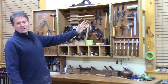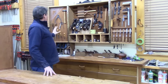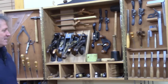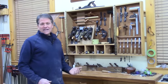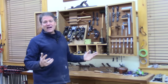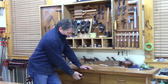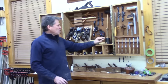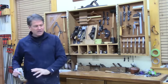I did that on cardboard before I got too committed to doing this. I decided to put my marking tools on the right side because I'm usually marking and cutting dovetails down this end of the bench. The planes had to go in the center section because they needed more depth. The saws seemed good up high, and just miscellaneous things I don't use as much over here. You have to decide, if you build your own cabinet, do you want it to be super functional? Like, do you want to be able to grab your tools and go, or do you want to fill it up with everything you have? In the cabinet, I wanted the things I use all the time, and I wanted everything to be grab-and-go and easy to put back again.